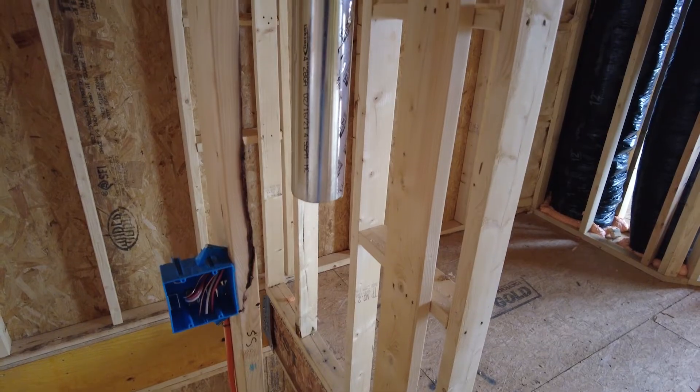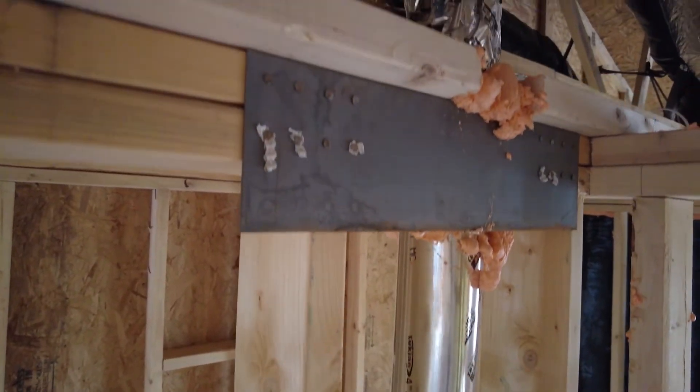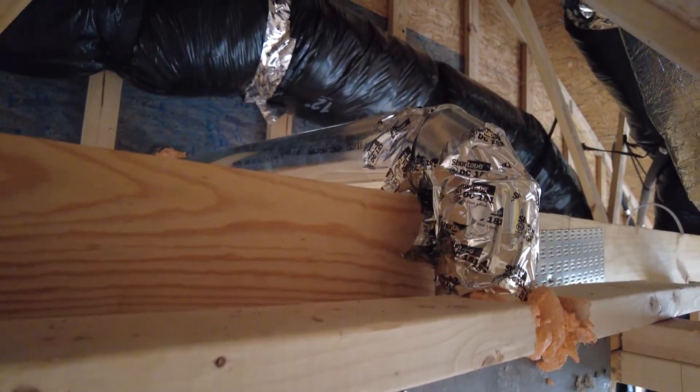I would hope they're going to have a dryer cavity that allows the homeowner to make a nice gentle sweep connection of the dryer to the vent. But the other thing I've noticed here is they've got a hard turn 90 — a bend in the pipe that's a sharp 90 degrees — and not only is that a potential place for lint to collect, but it's also a place that results in great friction resistance to flow. As the air has to take that hard turn on the 90-degree bend, it makes it harder for the dryer to actually push air out of the building.